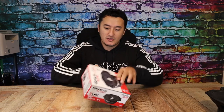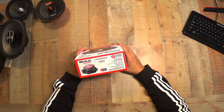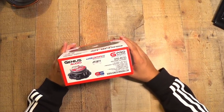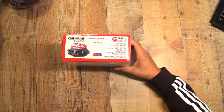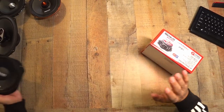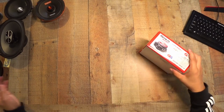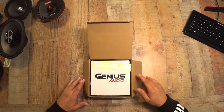This is the unboxing. This speaker is rated at 300 watts maximum power and 150 watts RMS. It will play from 135 to 8,000 Hz. The bigger neodymium magnet version I did in the previous video plays a lot lower, but this ferrite version plays a lot higher.